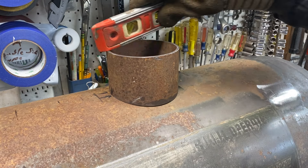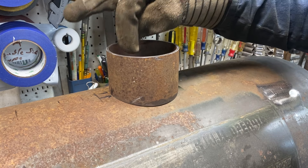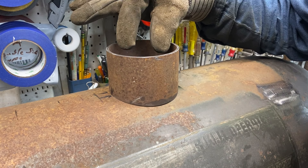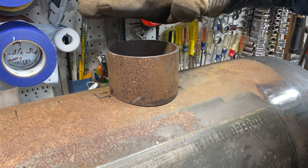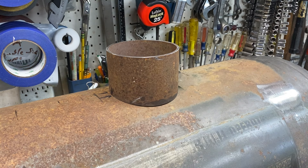We need to come up with a dome for this thing. On the prototype it's a domed lid, and on top of that is usually one with multiple studs and dogs that you tighten down like a manhole cover with pressure capability. I think a simple washer might get the job done. I'm formulating a plan: we can have a short section of small pipe with a washer welded to the top, another washer on top of that forming the lid, and some fake through-bolts that hold the lid together with the top flange. I think that's a workable solution — I'm going to look through my spare parts.